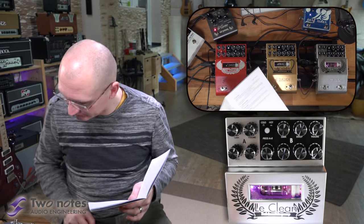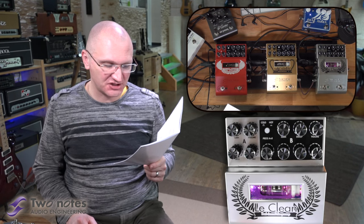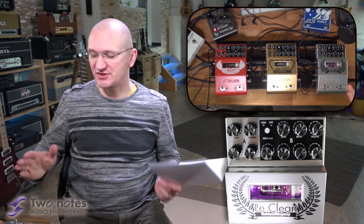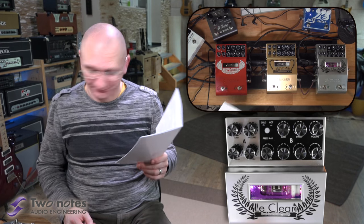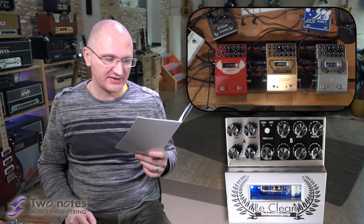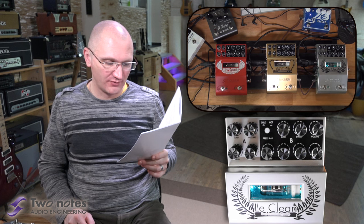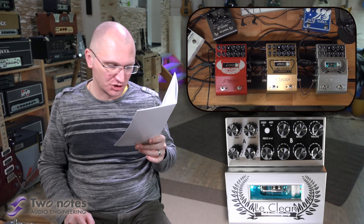Very, very clever. And then we have purple, which we haven't seen before. That is changing from multi-channel mode to a mode where they don't turn each other on and off, so that you could actually use one to push the other if you wanted that. Because right now, they're mutually exclusive. If one is on, the other is off. But I like that, so I'm leaving that. And then blue is a factory reset, and turquoise is the firmware version.